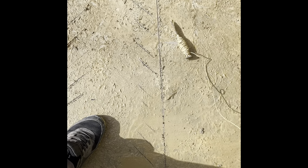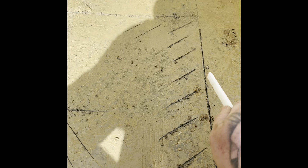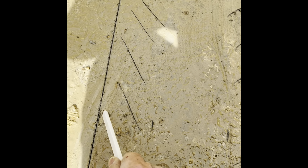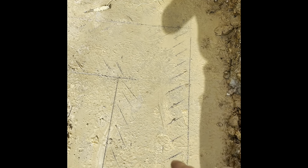I've allowed 102mm for the brick, and I've got a 135mm cavity. So these marks here - it's a little bit wet but you can see the external mark at the end of the pencil - that's the inside of my face work. We've got a 135mm cavity from there to there, and then a 100mm inner skin. So external brickwork, internal blockwork - that's how I've set up the corner.